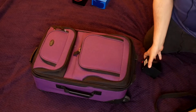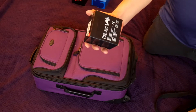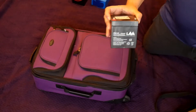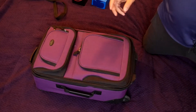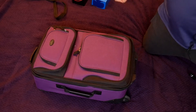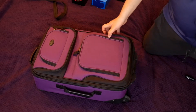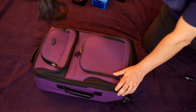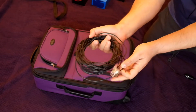So these are the two batteries I use for the radio. I have another battery, which is just a sealed lead acid battery — it's a small one, 4 amp hours, 12 volts. I got it to charge my tuner, which I connect right next to my vertical antenna. Basically, my antenna is not really tuned to any particular frequency — I use it on all frequencies — so I keep the tuner right next to the feed point of the antenna; that way I minimize my losses. Then I have coax running from the tuner and the antenna all the way to the car. The antenna, by the way, is just a piece of antenna wire with an SO-239 chassis connector soldered directly to it.